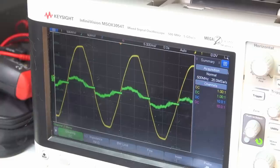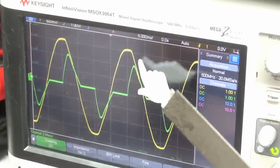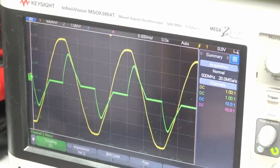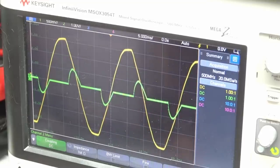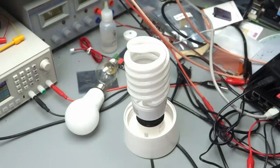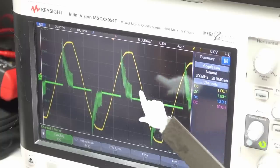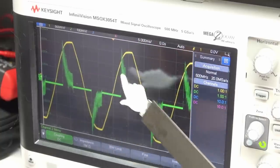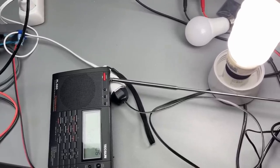Here it becomes evident that our power meters have to measure lots of points and do the calculations. Let's try a vacuum cleaner — again, a different profile. The current peak is behind the voltage peak, and its curve is adapted to the needed power, shown here at maximum and minimum speed. And now comes the worst: an old triac-controlled bulb. Here you need high-speed sampling if you want to get accurate power values. We also see that such loads can create radio frequency interference on lower bands.